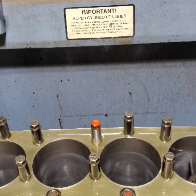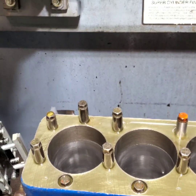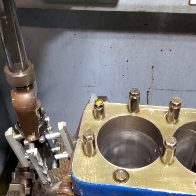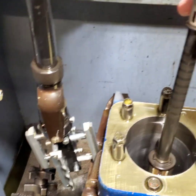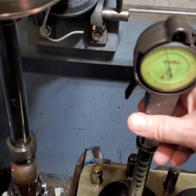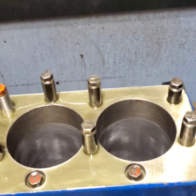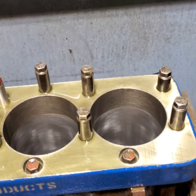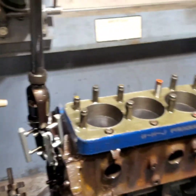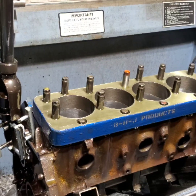Just waiting for it to cool down — about four or five-tenths, two-tenths, two-tenths. About four or five-tenths. I'm giving this just a little bit of extra clearance. The pistons were kind of on the tight side. I'll let it cool and finish it up, get this thing chamfered and deburred and get it in the washer. We're done.